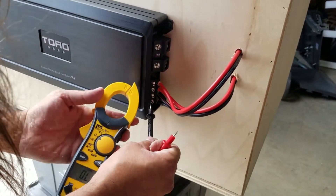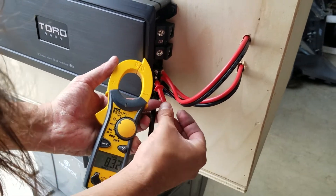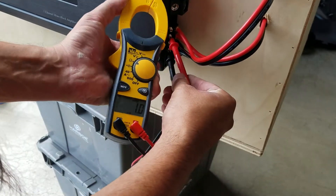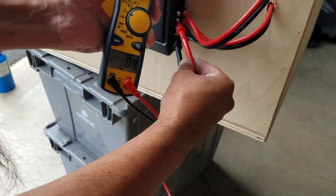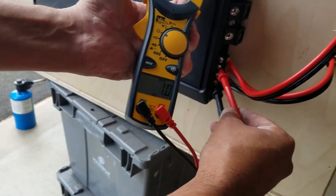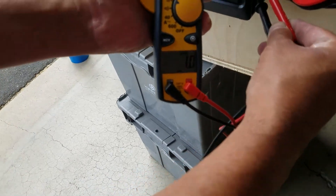Even though it's not fully connected yet, I should get about a one-ohm load — and yeah, I'm reading 0.9, essentially one ohm right there, without even tightening down the allen heads. That's because the two positives and two negatives are internally connected inside the amp.